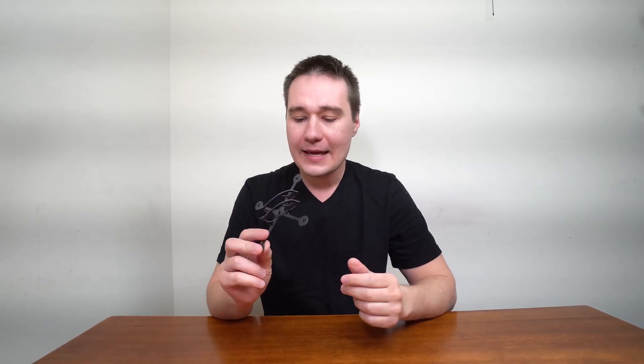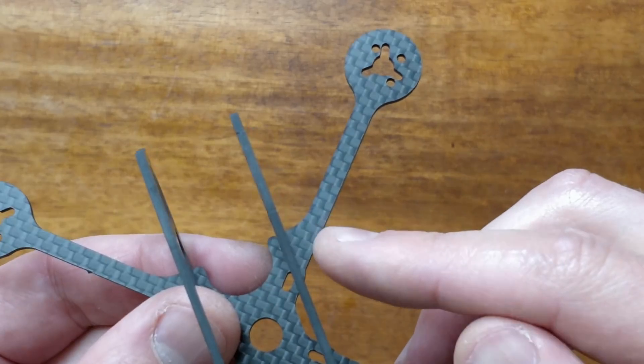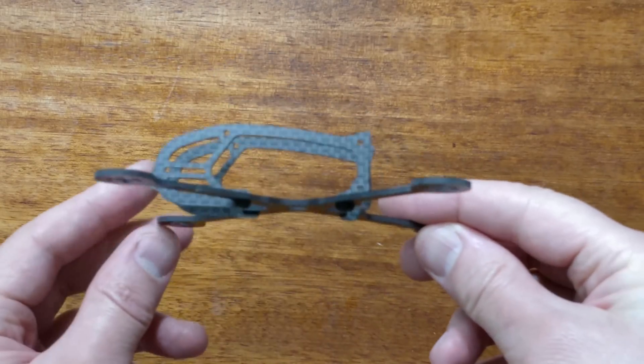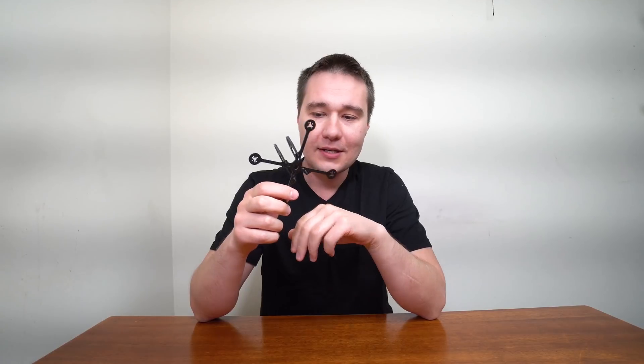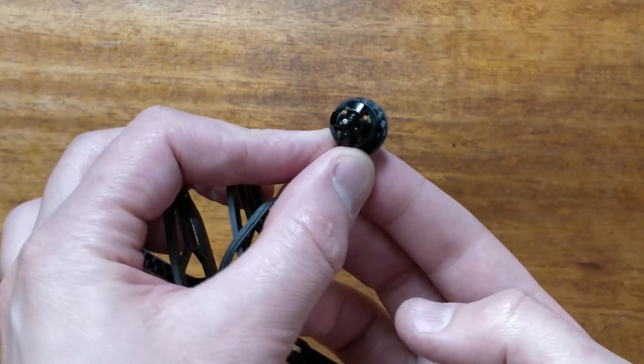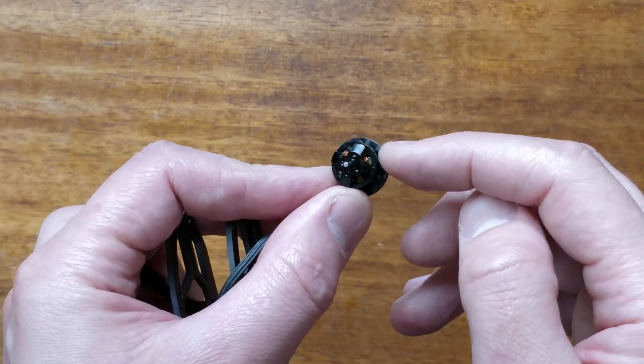The new design is based on S-cage design. The special feature is that it uses extra narrow arms, a lower cage, and it's specifically targeting 16x16 electronics. The goal is to have an extra light 2.5 inch quadcopter. I was specifically designing it to work with my 1102 motors, which nicely fit here, and they should have more than enough power to carry this model around — we'll see it in the test flights.